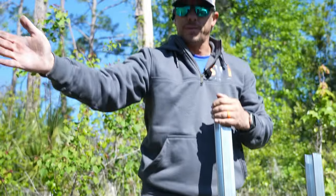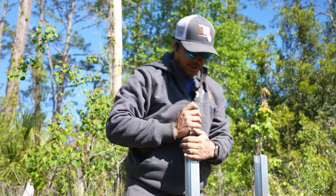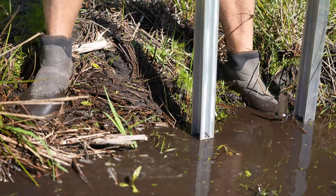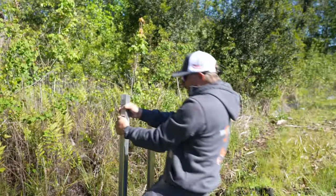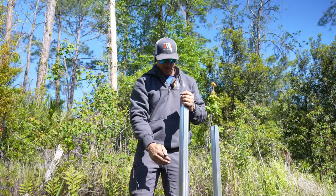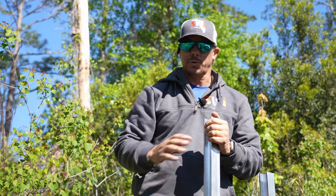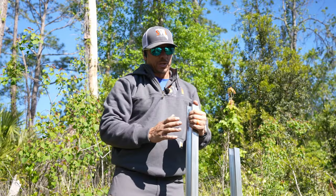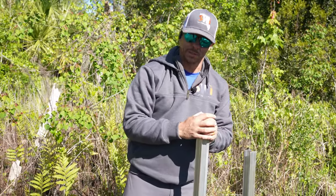Normally we would have additional fence off this way so they're not gonna twist as bad once the rest of the fence is connected, but it wants to twist just because I'm pulling so hard on them. And that's the only way we really get it to bend. If I was straight in line with the webbing, it doesn't wanna. Yeah, so I'm really working at this. We have driven this post to where we can bend the post. The biggest thing we're worried about is wind blowing on this thing and working it back and forth. That's why we're doing that. It's never going to go this way, but we're going to get it going back this way a whole bunch. It could potentially loosen up the post. Now, on an aluminum fence, we're not going to see a lot of that because we don't have a lot of surface area, but that's more important on your vinyl and your wood privacy fences.